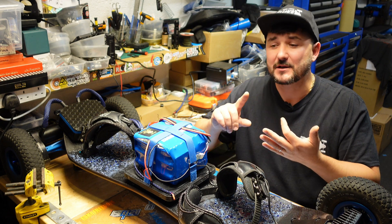The next very important part you'll need are the transformers. These take the voltage of your battery and transform it to the voltage your LEDs require. The LEDs on the front of my board and on the battery box are 12-volt rated, so make sure your LEDs are 12 volt or get suitable transformers. Most cheap transformers on the market create a lot of electromagnetic interference — a magnetic field all around them — so if the transformer is right next to your remote receiver, you might get interference with control of your board.